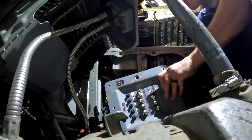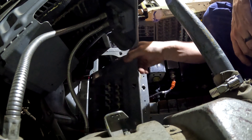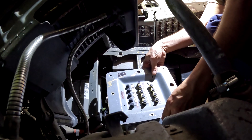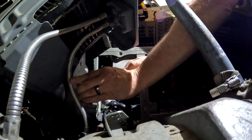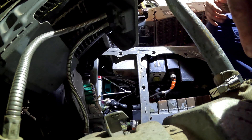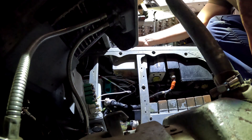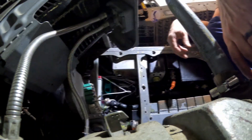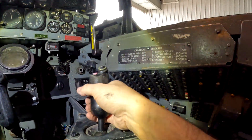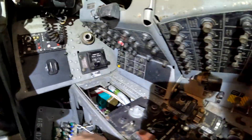Looks like something new to me. There's that screwdriver — we can swing that out of the way. What's that label? Oh, that's the GPS breaker. We'll just swing that out of our way for now. Take those four quick turns up here on the controller handle — there's four little quick turns, half turn each, and that box will come up and out. And you can reach down in there to get to it. Let's pivot aft. Now you can see the battery connector. Hand control unit for the radar, which is no longer functional. There's our battery, right back there.